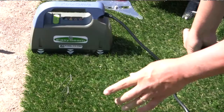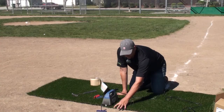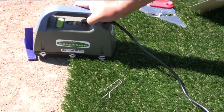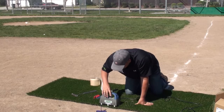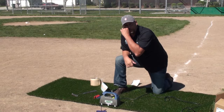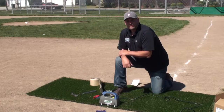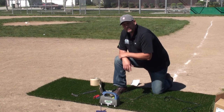Now one other thing I want to show you that this machine does. Say you get to the end of the line and you only have three or four inches of product that you have to seam together. Instead of coming up like this and having half the machine on and half off, you just turn it to the other side and now the arrow is right where the seam is. On the machine itself it has an H, which means you're turning the machine to the side — so now you are activating just in that area, just the width of the machine as opposed to the whole length. So you just hit the H, it knows it's cross seaming, you push the button, the green light goes on, it's activating there at the end. As soon as the green light goes out, you are done completely with your seam.